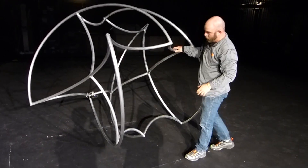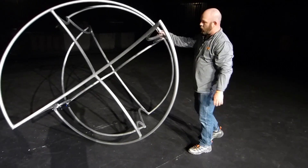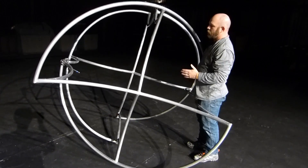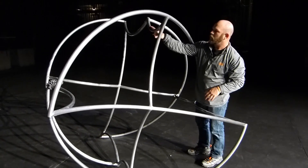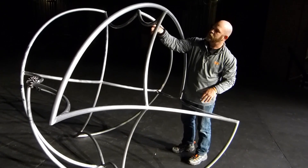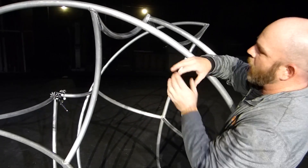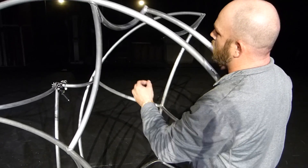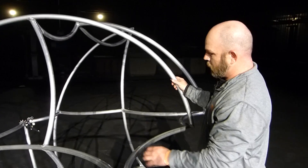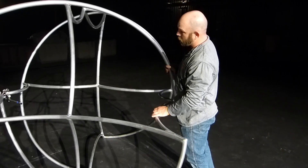That is where we're at on it, and hopefully we have some people in it performing in productions here in the near future. Right now it's built as one full structure. One of the next things we're going to be working on is separating this into two pieces along the small radii bends, and those are going to be cut and spliced with steel inserts and set screws so that it can come apart in two sections and be packed, taken somewhere, and reassembled. I'm going to be working with the engineering department to help engineer that so it takes the shock loads when it's in the air without any problems with performers or the apparatus.